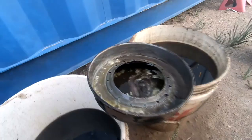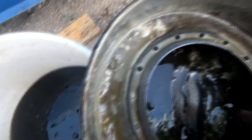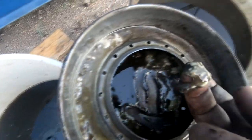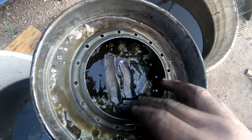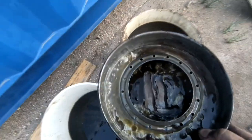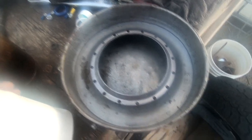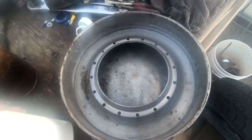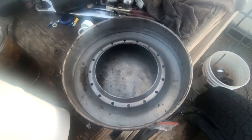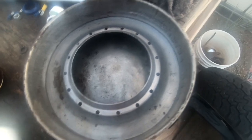Let's revisit this. Sticking my hand in here — there's a ton of sludge in the bottom of that. It's really fine dust, probably from out here working. It's almost like mud. I'll clean this up real good. I just let that soak in some parts cleaner for a little while, then washed it out. There was a lot of really fine dirt in there — maybe a quarter of an inch in the bottom of this. And there was also some in this track. So the oil bath filter is doing its job — it's catching the dirt.